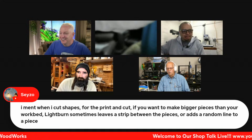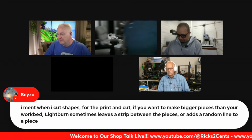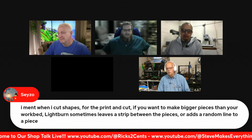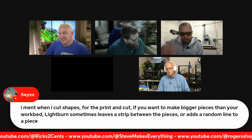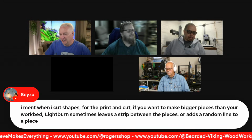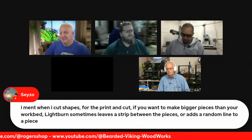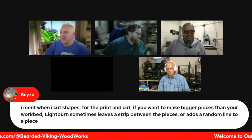I will put a word of caution out there for anybody trying to engrave a really old mirror. The silvering on a really old mirror is made of mercury. Don't do it. Yeah, mercury based for sure. That mercury will vaporize as it engraves through the coating. So don't engrave your great grandmother's mirror. Well, that sucks. I was actually thinking about doing that exact thing. Go to the dollar store and get a piece of glass.